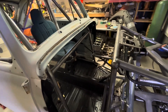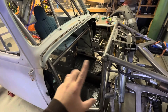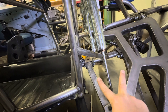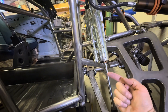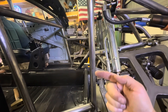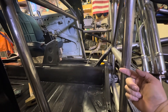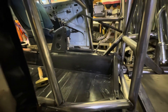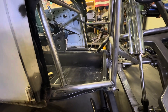The first tubes we're gonna be installing are these top corners. We need to tie this one into the main cage and have some amount of triangulation. This tube here runs down into the front in between the lower A-arm — that tube is actually going to take quite a bit of load whenever we're hitting stuff in the front. Big hard hits, that load's gonna drive up through here into this vertical tube, and we need to drive it out into the rest of our chassis. I'll be driving that one straight up right into our A-pillar.